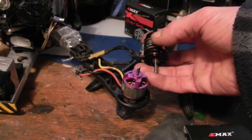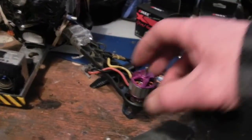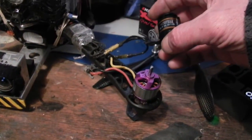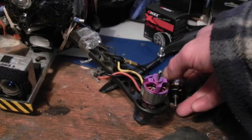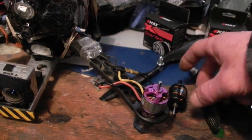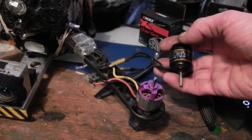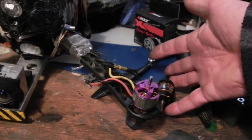Hopefully it'll be a stronger motor in the lift. We'll also check the OSD from when we were running these RC Timer motors — we'll check the draw — and then we'll check the draw when the OSD is running with these larger motors, so we'll see how much more amperage these are pulling. I was pulling about 19 to 22 amps hovering and flying around. Probably around 23 to 27, maybe 28 with these — but who knows, they might go right up to 40.